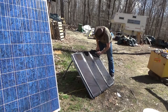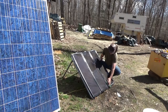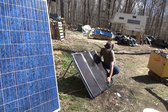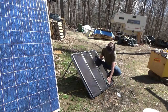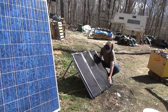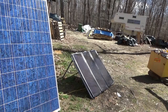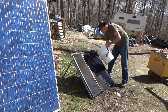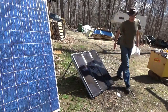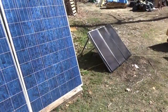There's no real schedule as to when you should clean these — just keep an eye on it. I talked to a guy, Dan G, a student who converted his playground into an off-grid home, and I'm going to be profiling him in a video soon because what he's doing is really cool. He's got bad pollen going on right now. During pollen season you're probably going to want to wash your panels just about daily — pollen is going to completely trash your solar panels, so cleaning is really important during that time.